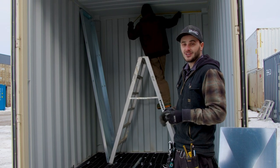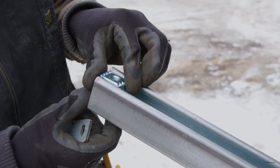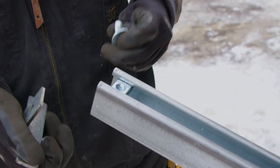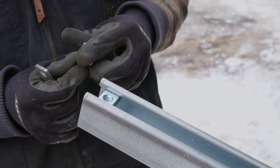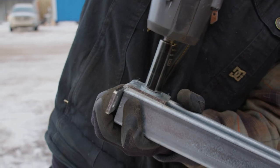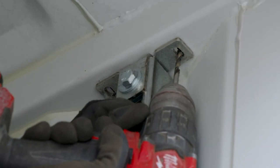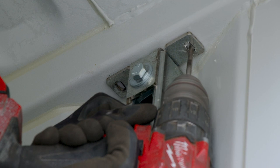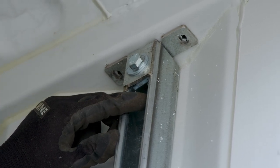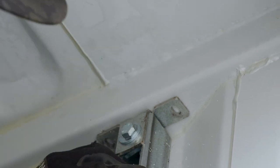Once you can strut-line, you've got all these options to organize your life using our modular interior systems. With this square tube mount, we think we can kind of pre-install the brackets into the strut channel prior to holding it up, and then hammer our self-tapping screws through the top. Because this is a bar-grated floor, we'll be using longer self-tapping screws to go through the bottom. We already have all the spring nuts and hardware dialed in. And because it's a hollow tube, we're not actually drilling right through the roof of the container — so these self-tappers we put in here, nothing's penetrating the can.